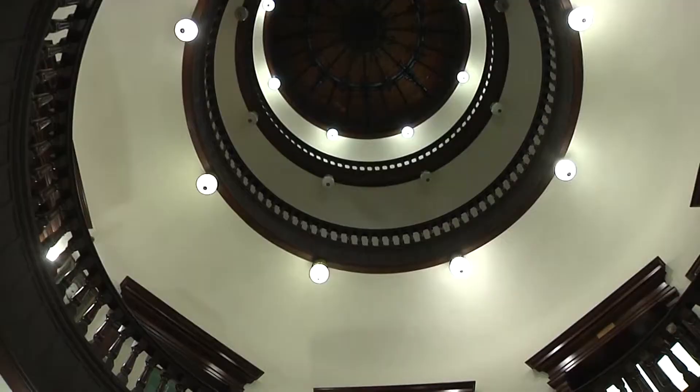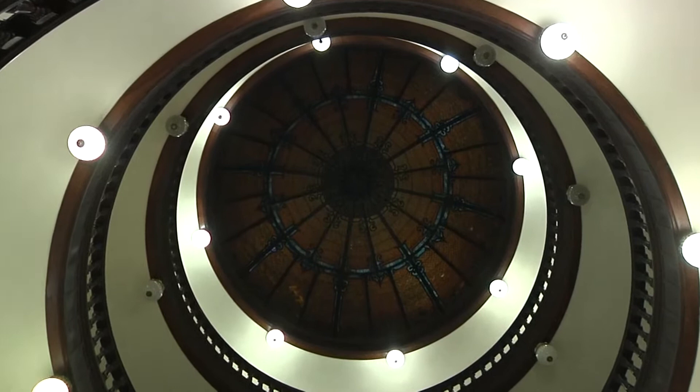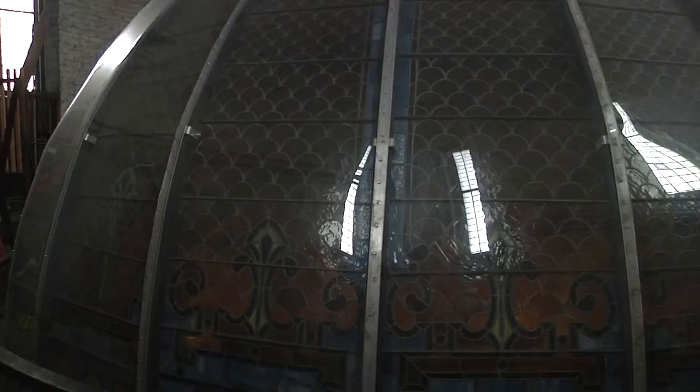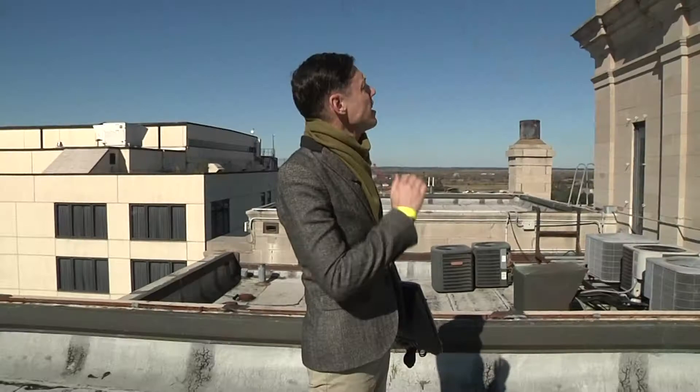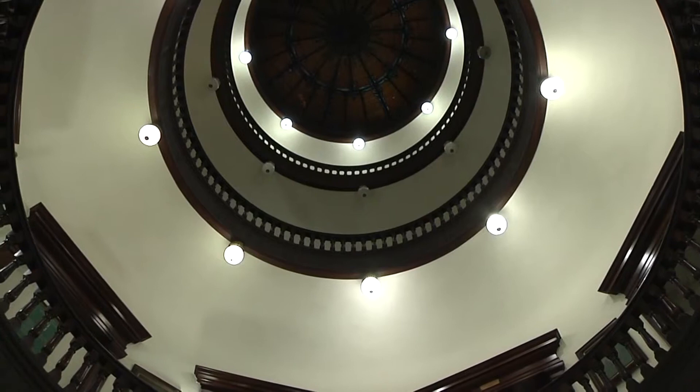This dome is a combination — built on top of a masonry base and using steel arch supports as it goes over the arch. When we were walking up here, we saw some fabulous stained glass. We have an inner and an outer dome. The stained glass on the inside blocks the view of the steel ribs going through the dome. The outer dome protects that ornate stained glass from storm damage. It also creates a layer to house all the clockworks and the illumination for the stained glass. The slender windows on the outside primarily bring natural daylight into the stained glass so you can see it from the rotunda below 24 hours a day.